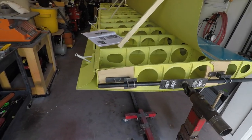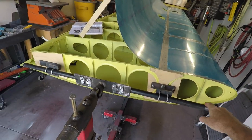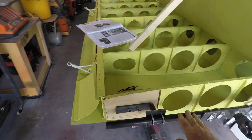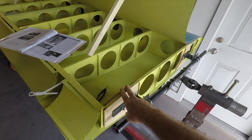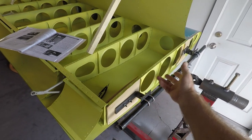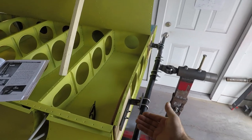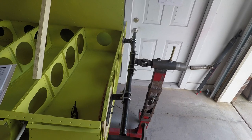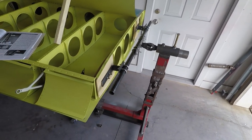From that point, we can begin thinking about installing the wing tip, but that's not going to happen until after we remove the wing from the rotisserie. I'll probably set this on a table and put nut plates in for what's going to be a flush-mounted or butt-joint sort of a wing tip. I'm trying not to have an overlap — I want a smooth transition from the wing tip into the wing itself.